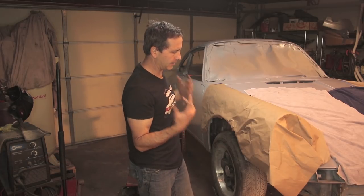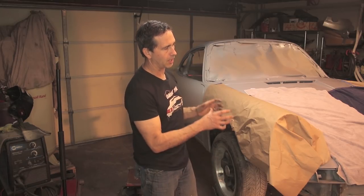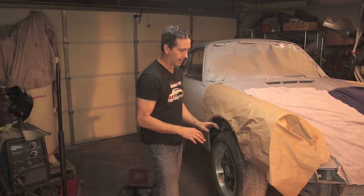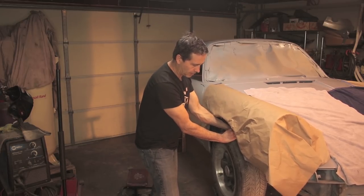I also have some work to do underneath the car, and I'm not gonna go underneath this car quite yet. Just like with any jacking system, especially a new one, there needs to be some redundancy involved. So to go underneath this car, I would put some chocks on the front and the rear, a stack of tires or something to catch it if the car does fall, before it falls on me. Now, the car does seem pretty stable. There are the struts, and a lot of suspension is loose on here. So that's another reason not to go underneath it.